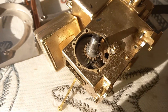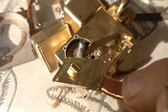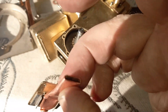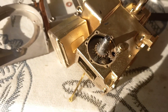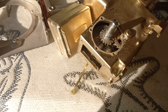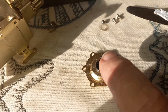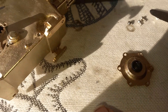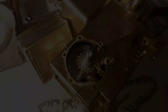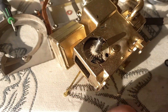Here we are — that's the little engine from the tractor. I've been making a much bigger breather hole, which is also able to fill oil through. We're going to put some sealer around the edge of this to stop oil leaking out. I've already put a little o-ring and a washer on there to stop oil from there, but we want sealer around the outside as well. Sealer's on there and a bit of oil — we're going to reassemble that now.